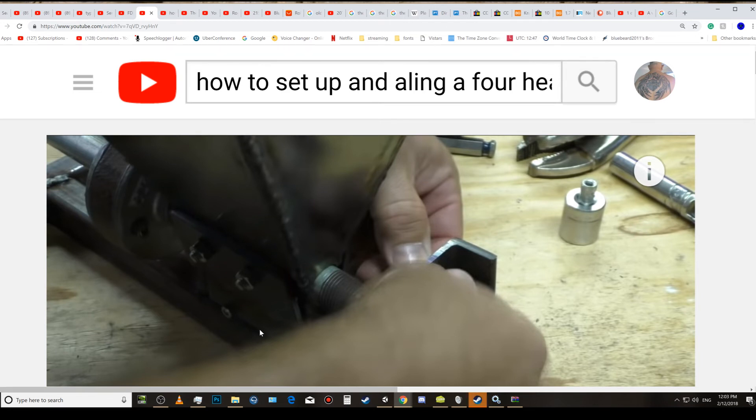Use a different type of screw — you're going to get better plastic flow regardless of pellet size, because a lot of you are going to be using recycled plastic pieces. Blend it up in a blender, and I would even recommend running it through a machine first with a chopper at the end to make pellets, then using those pellets. But it's up to you — you can go straight through with recycled plastic, but it needs to go through your hopper dryer first at 40 degrees with a tornado-like effect.